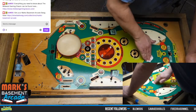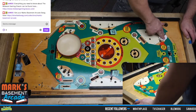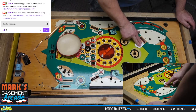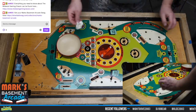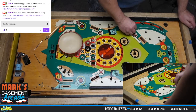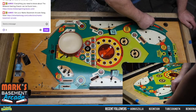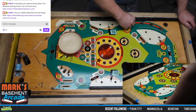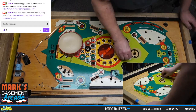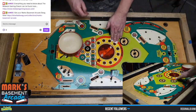That will actually prolong the life of your balls, because it keeps them clean. And that rock tumbler puts a new polish on them, and that polish is what protects them. In my rock tumbler I put a little bit of 3-in-1 oil in with them when they get tumbled. So that all protects them. And then when you're done with the pinballs, you wipe them off with some naphtha or something like that. And then you can put some wax like this, not chemical garbage, but wax. You can throw a coat of wax on them, and that will keep them good. Then all these areas will be good.